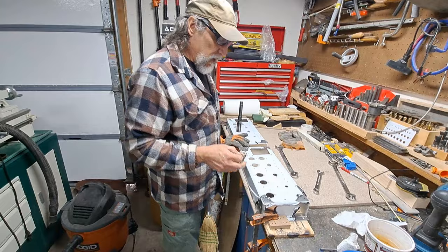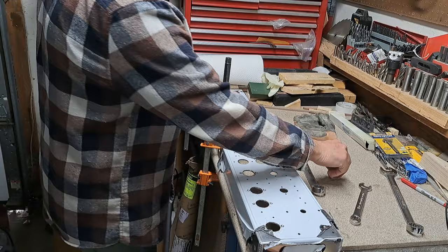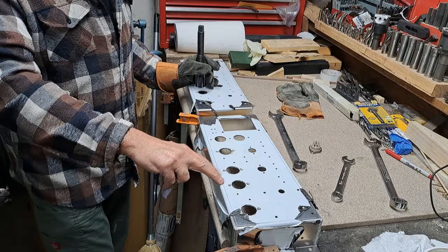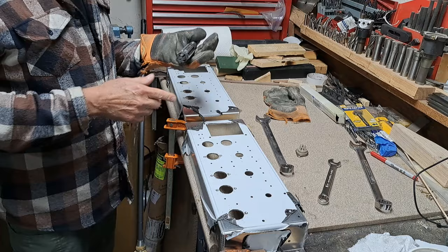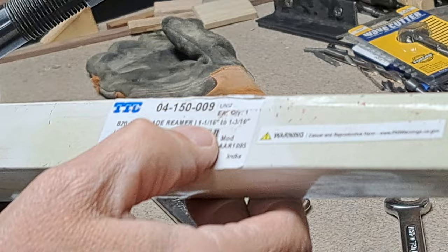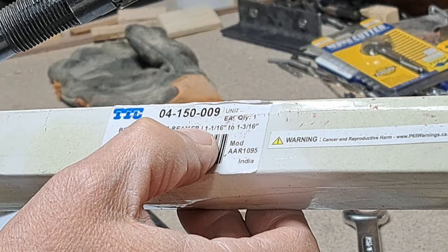If you're going to lay these, it's fine — you just run your program. I happen to have some chassis cut for one and an eighth, though. One of the only tools in the world — I can jig this up in my milling machine and mill this bigger so everything remains on center. But that's a lot of work. There is a tool in the world called an adjustable reamer, and they're specific to the amount of size at the bottom and at the top. This one is one and one-sixteenths to one and three-sixteenths, so it makes it an eighth of an inch bigger. You can take and make it any size you want in between there by continually adjusting these.